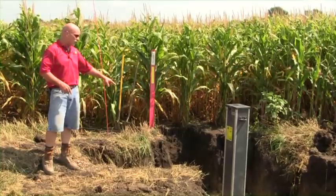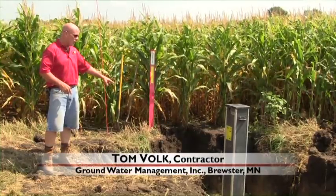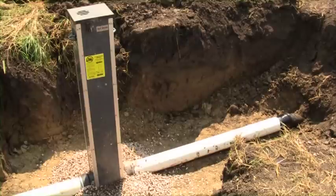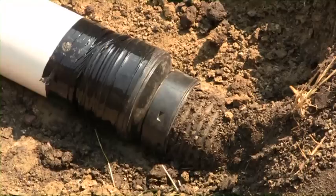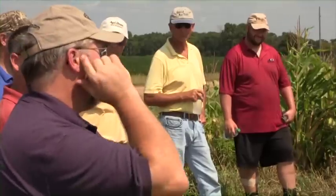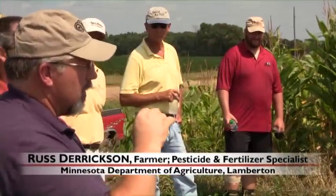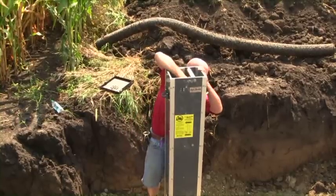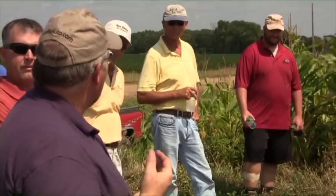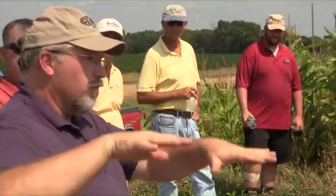This is a 6-inch structure. We put 6-inch PVC on each side. For the first part of it, you want to use non-perforated so that the water doesn't try and bypass. We use a rock base underneath just to help stabilize it, and then we backfill it up to grade and put a marker by it so it doesn't get hit. After we get the harvest off, we'll put the stop logs in and we'll probably hold it within two feet of the surface all through winter. Then about a week and a half, two weeks before we think we're going to plant, I will pull the stop logs and let the profile drain out.